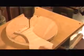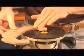He drills 2 assembly holes in the top piece and makes corresponding holes in the other parts. He smooths the edges of the backbone with an oscillating sander. Then, using a high-speed router, he bevels the lower bout piece to give it a clean edge. He rubs teal-colored stain into the wood because loud colors seem appropriate for these high-volume instruments.